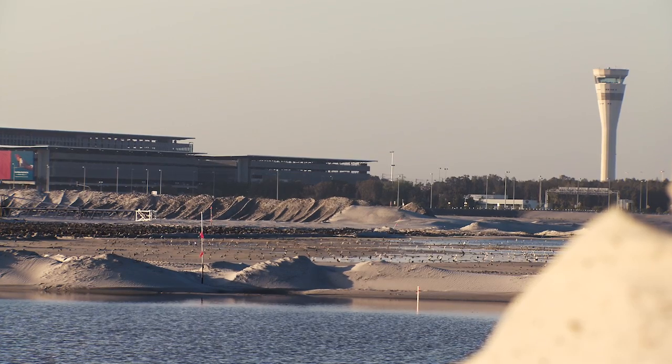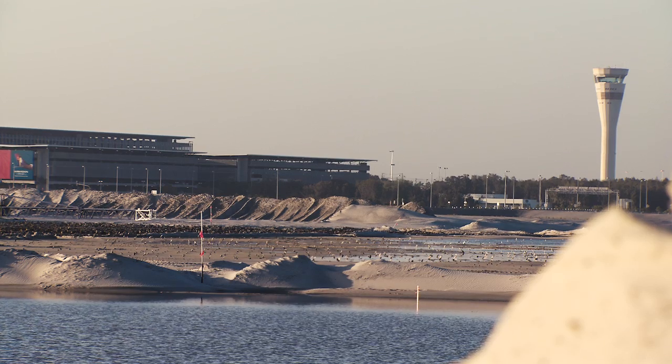You can pretty much say where the sea used to be — you might have 30 metres of marine mud and you want to build something over it. You've got to consolidate the material; you don't dig it out, it's way too expensive and way too difficult.